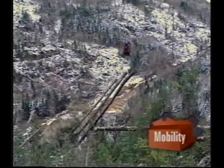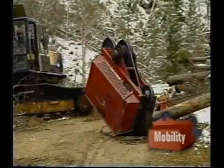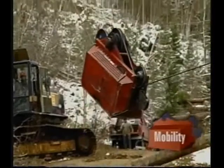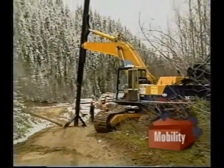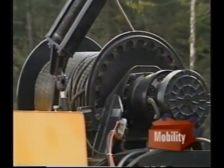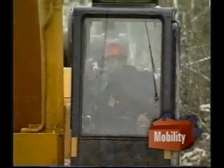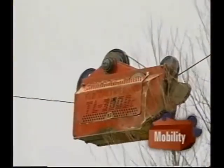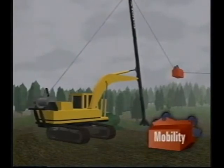The telecarrier offers its users incomparable mobility. The skyline is anchored between two excavator-mounted steel spars. Proper cable tensioning is provided by hydrostatic winches adapted onto each excavator. No additional anchoring is necessary. To move from one setup to another only requires loosening the skyline and repositioning either one or both excavators.